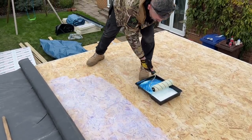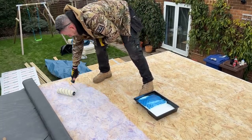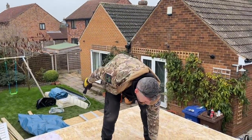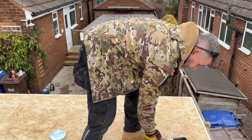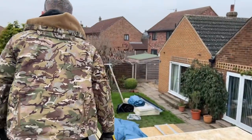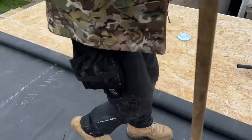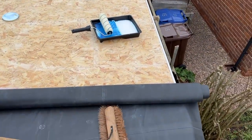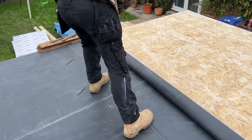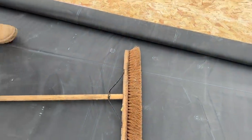This time of year it's quite cold — it's not forecasting a freeze tonight so we're good. I have fitted this in well below minus four and had absolutely no problems with it whatsoever with the precautions we took. Right, so that's my stripe. I'm going to stand back, stand over it, don't walk in it. I'm going to roll it out, leaving about two inches from the end, so I can get my glue on and then roll it out. Brush it like so to get all the bubbles out. It's not going to go off too quick in this weather.